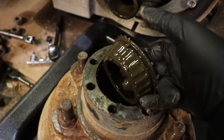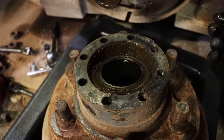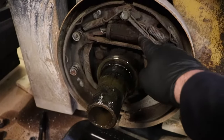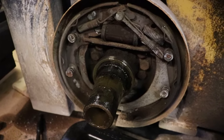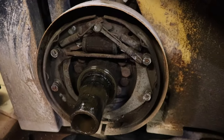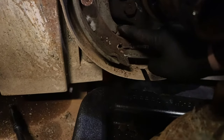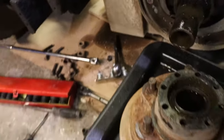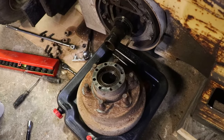I have to get these bearings out, get the numbers off of them, or just order forklift parts using the OEM numbers rather than the bearing manufacturer numbers. I've got to look at the brakes and see if they're leaking or not. I think that since I've got this apart I should probably just change the seals and the wheel cylinders — these aren't really known to be very good, it's a pretty standard part that needs to be replaced. You'll see where the parking brake cable comes in and grabs this part here.